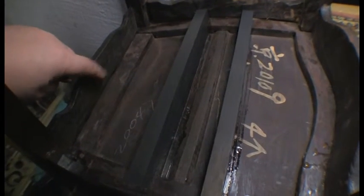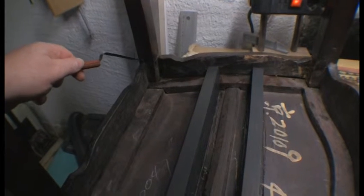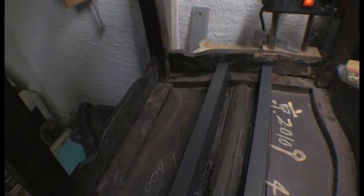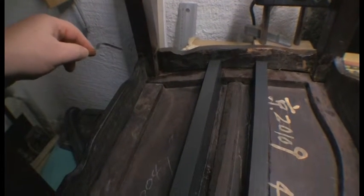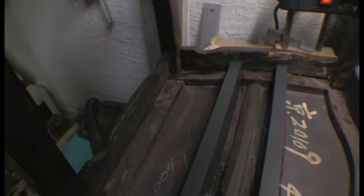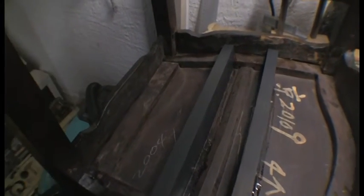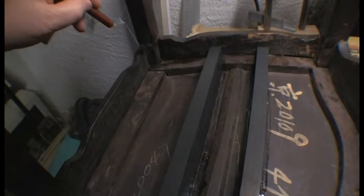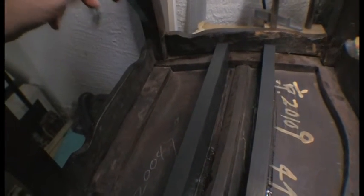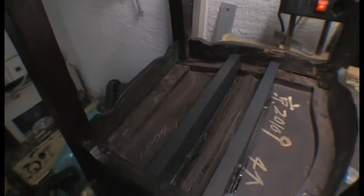The other piece I had to fix was this bar at the back, which was loose because the wedges at either end had basically shrunk. I replaced them with ebony wedges, so that now transfers the load from the top into the side piece as well — transferred down — which should reduce any movement in the future.